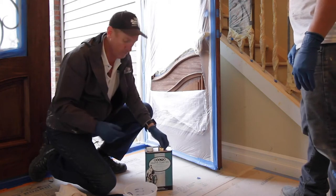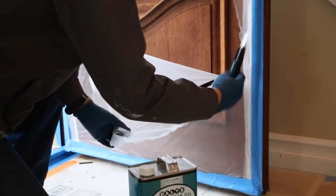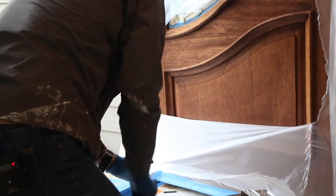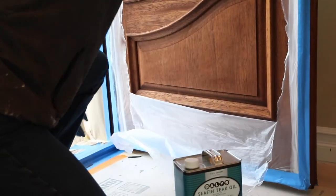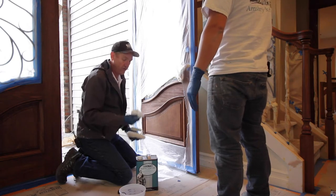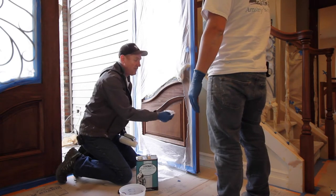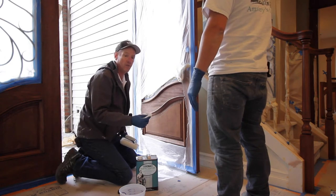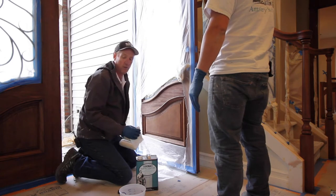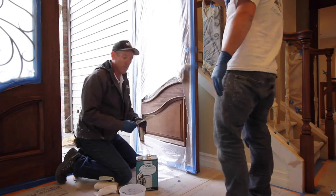Because this is a demonstration, we're going to access part of the door. Be very careful not to touch the door with the knife. Because these are mahogany doors, they're very porous. The stain we put on here has got some pigment to it. If I just use a rag only, I run the risk of pulling the stain because the stain is also solvent based. And if I put a solvent based product on here, I could accidentally pull the stain out. So I'm going to apply this with a bristle brush.